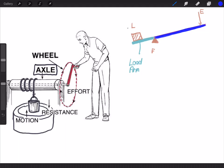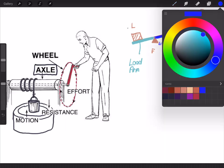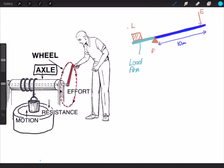And let's say that this distance here was 10 meters. And let us imagine that this length here is 2 meters. So the effort arm is actually longer than the load arm. We can work out how many times easier it will be to lift that load by simply dividing the length of the effort arm by the length of the load arm. In other words,